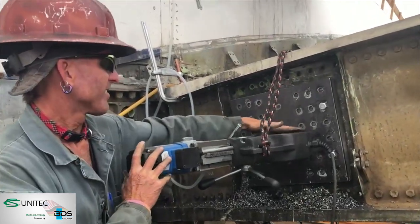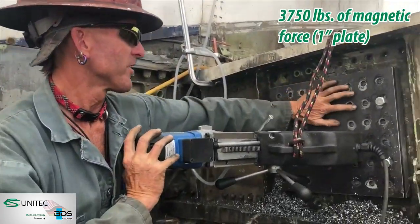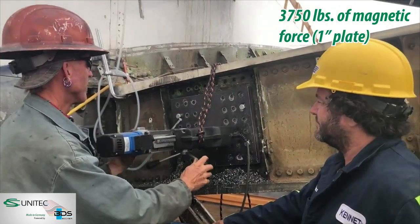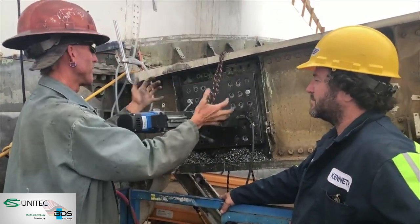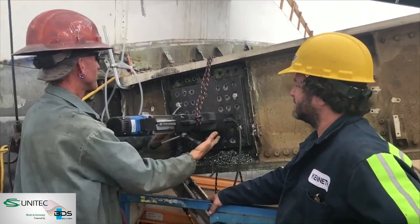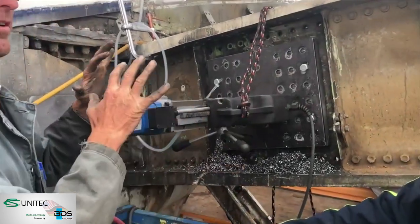The magnetic base on it is rated for over a ton of magnetic pull against this plate. I could stand on this and it wouldn't come loose from the plate. So it gives a stable platform. You can turn the magnet off and reposition the drill by hand — it's light enough that one person can handle this. Once you're lined up, click the magnet back on and you're right where you need the drill and it will not move.